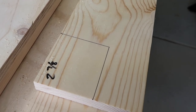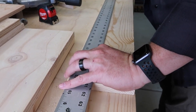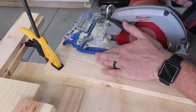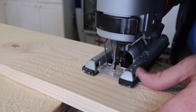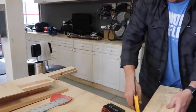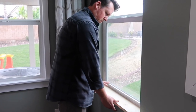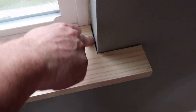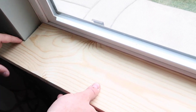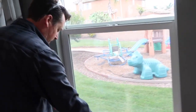I take my straight edge and draw a line that goes from this corner right here to right there. You can tell just how it is — I know this is square and I know this is square, so the sill just goes like that. Regular caulking will take care of that. We cut this at a shallower depth and you can tell it touches the corner almost and is completely flush against the back side, so it worked out perfectly.